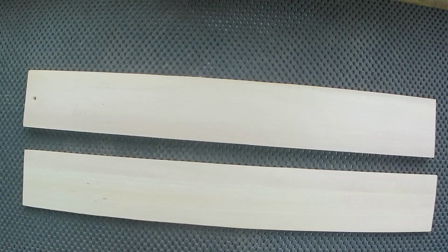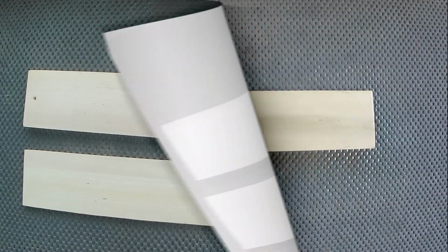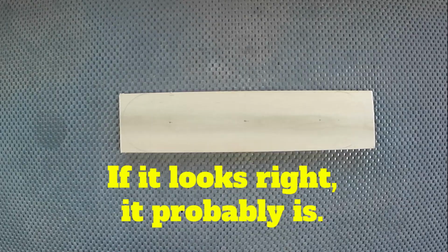The wood came from a recycled slat, which had already been planed to 62 mm wide by 17 mm thick. The dimensions, however, are not critical. They were simply the sizes of the wood in this case. The length of the base was dictated by the size of the largest disc, which was approximately 59 mm in diameter. The center distance between the rods was 76 mm, and the overall length of the base, 225. No mathematical formula was involved. The sizes were based on the old drawing office adage that, if it looks right, it probably is.